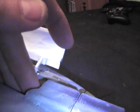And by doing so, you're actually going to have to Dremel out a little bit of the foam from the original retract hole. So you have to make a little extension here, and then I kind of hollowed it out so that when it's in the airstream, it's not a big chunk of block right there. Plus, it gives a little relief for the wheel. The nose gear sits down at probably about a 5 to 7 degree forward rake on it, which looks really nice, and comes down real nice and smooth in there.